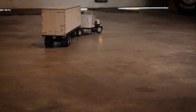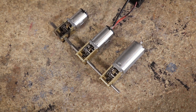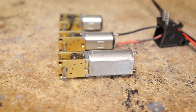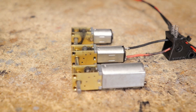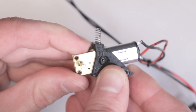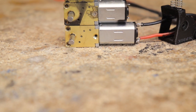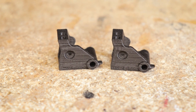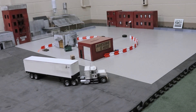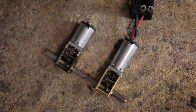Fortunately, there are a couple of simple solutions. I decided to start with the N20 size motors to get a baseline of performance and then move up as needed. Technically they are the most compact, lightweight, and least expensive, although by RC standards all of these motors are extremely inexpensive. I think the slightly larger N30 motors are better in every way, and they fit the same motor mounts — they're just slightly longer. At this time I don't really see any reason to buy an N20 over an N30. The N30 motors seem to provide noticeably more power and can have a higher top speed with only a slightly larger footprint. If you're going to do a project with this style of motor mounts, the N30 is going to be the way to go. That said, the performance difference isn't huge — I'd still only recommend it for driving over smooth, flat surfaces, but certainly better performance, even if still not great.